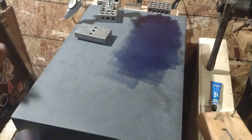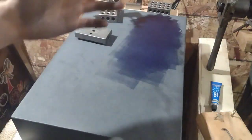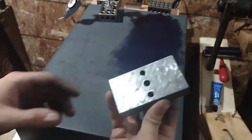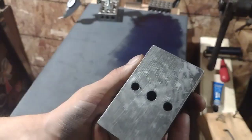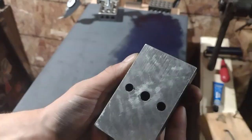Okay, so that's pretty thin. Kind of spread it out just from that little bit. It's gone really far. It's still pretty concentrated over here, so we can kind of wet it later on. But stone this, done another roughing pass with the scraping. Please don't laugh. And I know it's awful. And you can kind of see how slow the material removal rate for scraping is. You can kind of see all these scoring marks from the file.